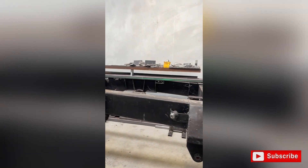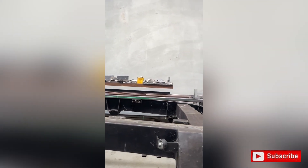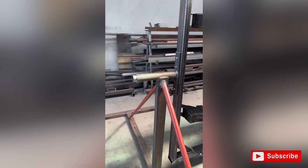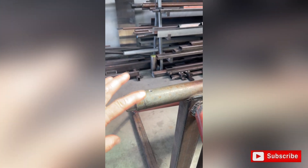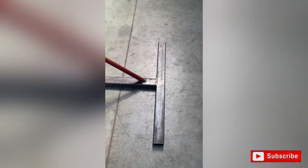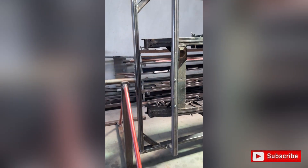This time we've put an alignment line across the top of the top bed — you can see that line running down through one of our positioning bars. Here's our end piece: we've just got a pipe-in and pipe-outer, ran that through the lathe to make it nice and firm. There's a fixing bolt underneath to hold this collar on so the jig can't slide out. We're debating whether to put some wheels and big casters on it so we can roll it around the workshop.